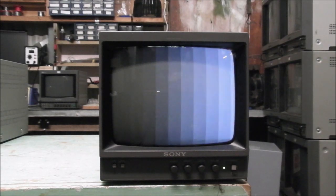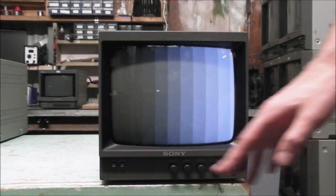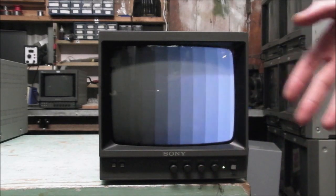It's a fairly simple unit. I'm not sure on the date of manufacture — perhaps we'll find out when we go inside. I have a ramp grayscale on the screen. It's a little bit darker than it should be down the left end here. The settings are all at neutral. I anticipate the tube or the monitor, the combination thereof, is a little worn out, hence the darkness on the left side.